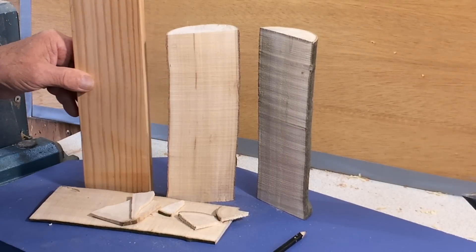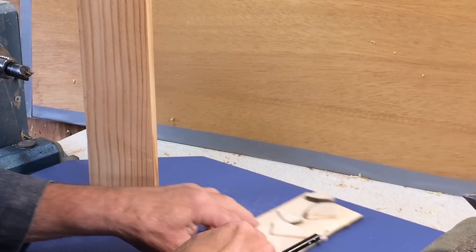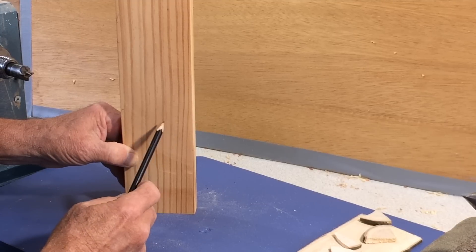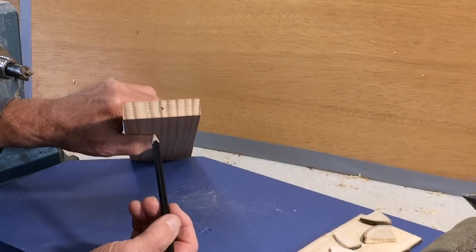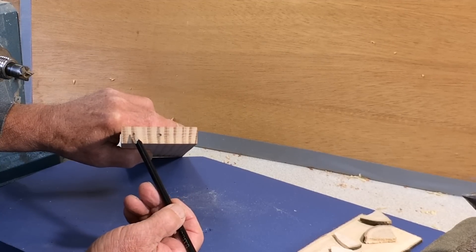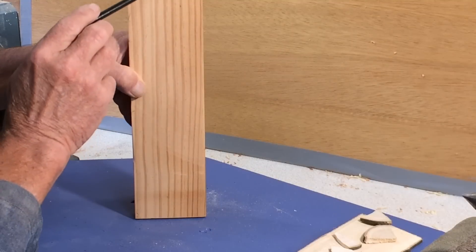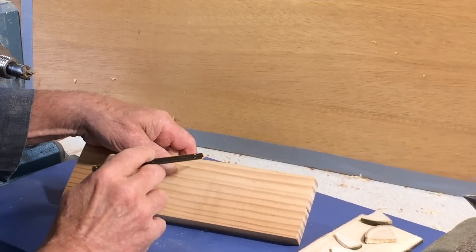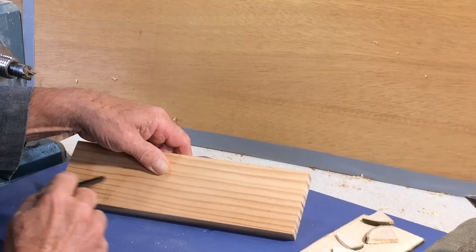A piece of pine like this was growing in the tree this way. The strength is in the growth rings — the annular rings — which are fairly strong and visible on the end grain. When wood dries out, the soft pulpy material here is what holds the moisture, and as that dries out the wood shrinks in width. But the hard bits — the length — barely shrink at all. So this piece will get narrower, and with seasonal changes might even expand a bit, whereas the length stays pretty much the same.